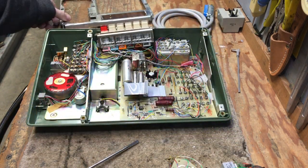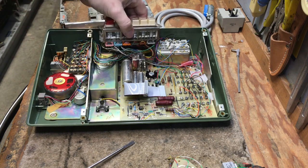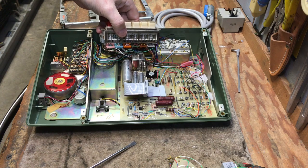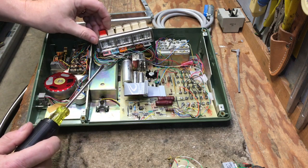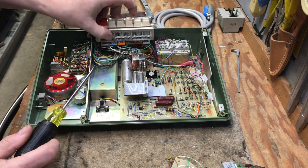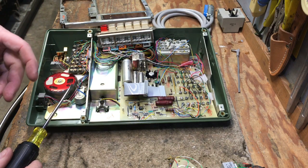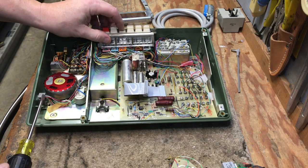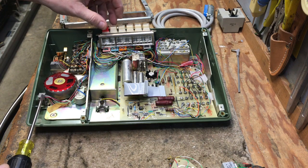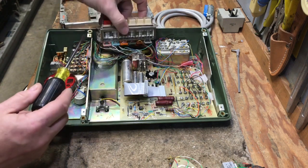So we have the metal ring and the dial assembly, matrix dial, removed so you can see the power board. This is a standard 2851 key strip with an additional switch on here. So when you change from one line to another, you clear out anything that was in the memory. If you use the last number redial, you want it to only dial the call; when you change from one line to another, you don't want to hit redial and have a misdial because you have a partial number. So this switch is very important to have.